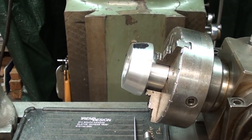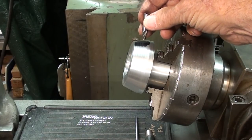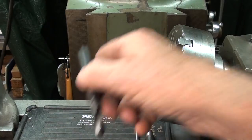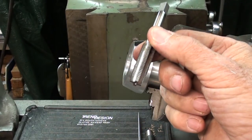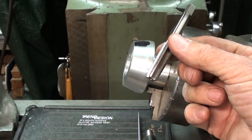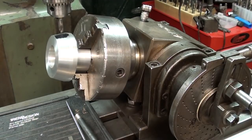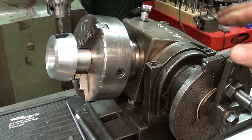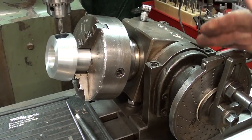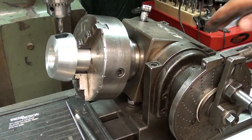I'm going to do something a little different here. Since it's easy to index, I'm going to go all the way around and spot all three holes first, then go all the way around and drill 9/16ths deep, and finally power-tap them — because I'll have to slow the Bridgeport down for tapping and I don't want to change spindle speed three times with my standard J-head. If you've never done this before, I recommend a practice run, a rehearsal. Even though I'm 74 years old, I always do a practice run — no sense spoiling work that I spent hours making and filming.